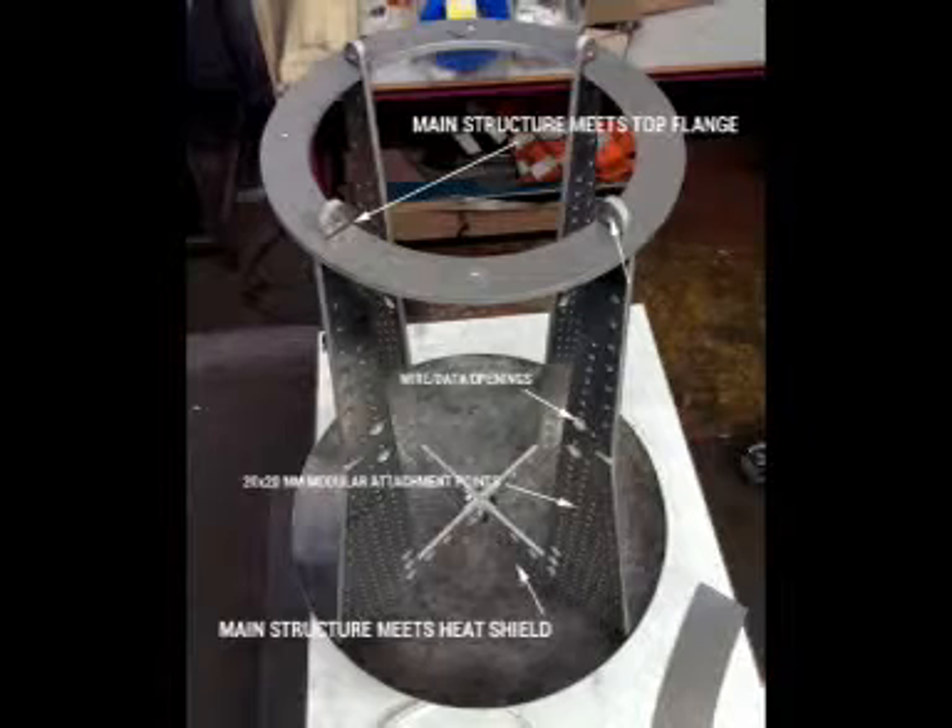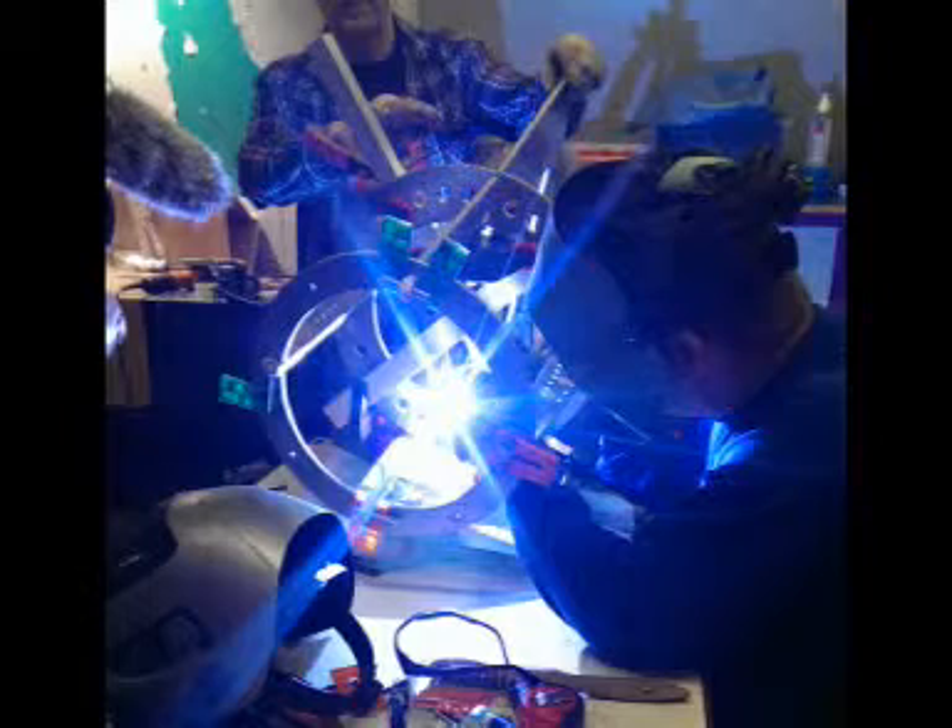The side structure of the capsule is likewise flat laser-cut parts which have to be manually rolled to obtain the correct curved shape. SolidWorks is a big help to flatten curved shapes for cutting, but the rolling procedure does require some expertise and hands-on skills. Always remember to pre-bend — with a rubber hammer and a block of wood — the edges of such a sheet, since the roller cannot reach the end pieces.